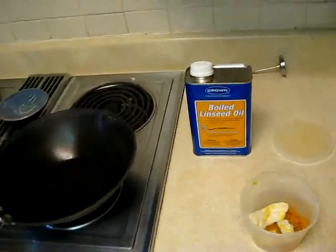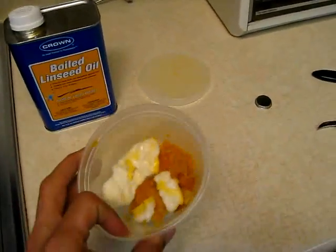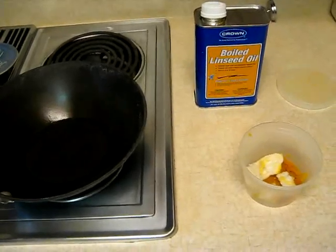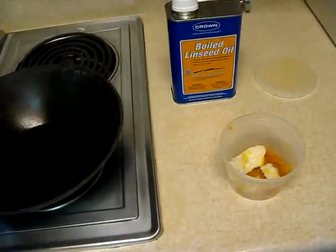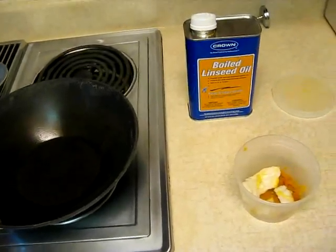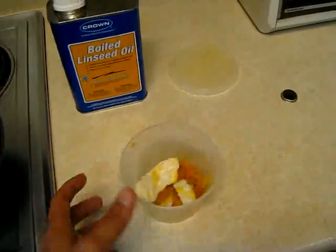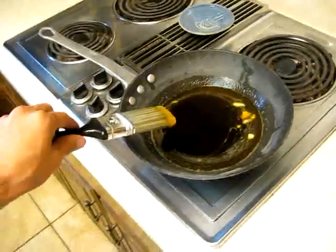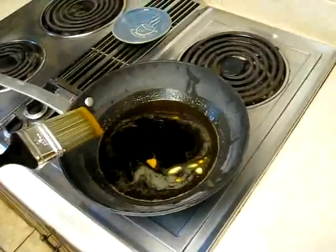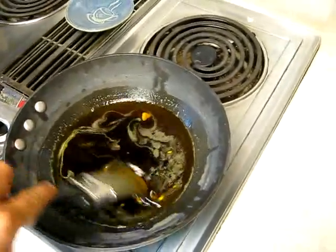Here I'm about to start up the preservative concoction. Boiled linseed oil on its own will preserve wood, but it's better if you add beeswax to it. I've got some beeswax — I haven't used it in linseed oil before but I've read about it, so I'm going to use it this time. It's supposed to be about 5, 10, or 15 percent by weight. I'll melt it under low heat, and when melted I can start painting it on the wood parts of the top bar hives and the ends. I am not painting the inside of the hive at all. Under low heat most of the beeswax is melted, with a fire extinguisher nearby, and I'm about ready to start painting.